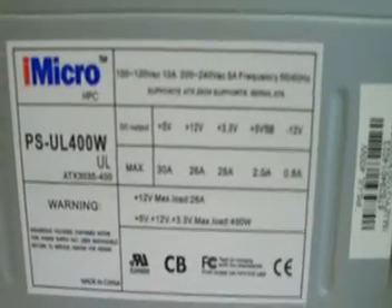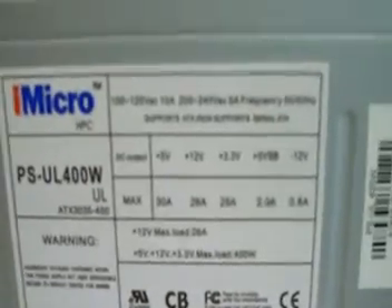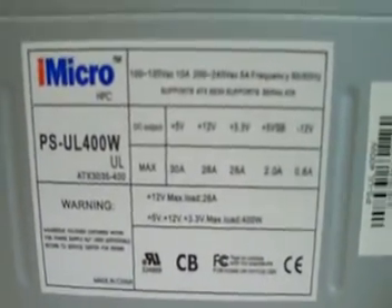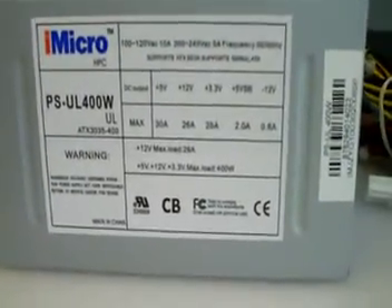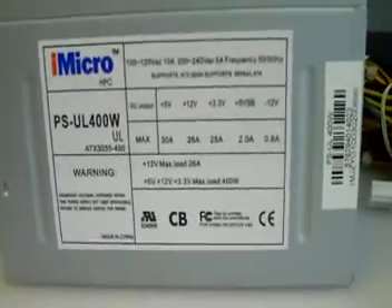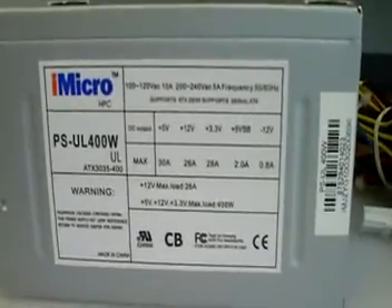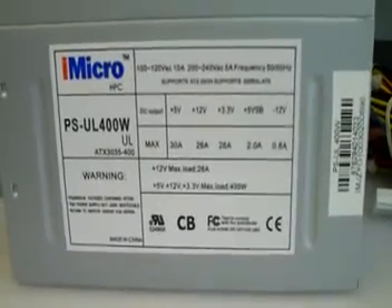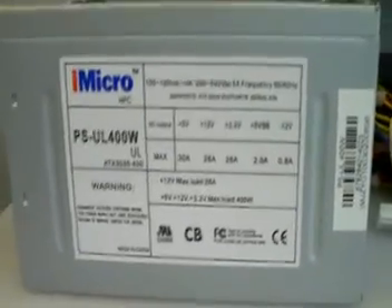I'm getting myself a 25-amp breaker and a 25-amp meter so I can create a new power supply. Next video I'm going to go through exactly how to convert this PC power supply into a lab power supply — the whole process, from unscrewing the plates, what wires to snip, what wires to join together. Hopefully that'll help you guys out.